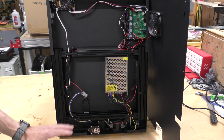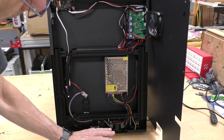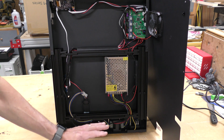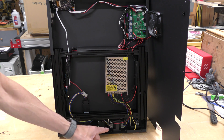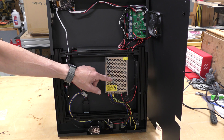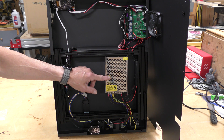I've got the printer on its back with the cover off. A couple of cool things: first of all, it just uses a solid state relay for the heated bed, so this is using straight 110V for the bed and not 24 volts. It heats up really super fast, and because of that, they're able to use a 200 watt power supply for everything else. This is a fanless unit, so it's very, very quiet.